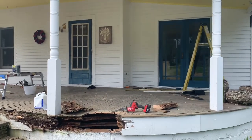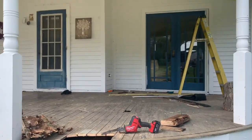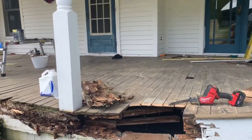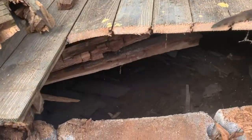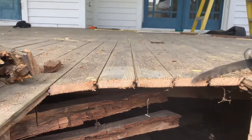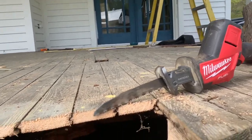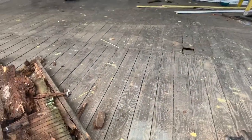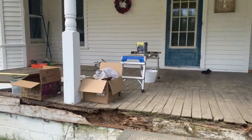The project today is removing the wood decking on this porch. It was originally a three-season wraparound porch that was opened up about 30 years ago, so we have excessive rot underneath it. I priced out doing Trex but it was way too much money. I don't have to rebuild the whole sub floor. Pressure treated doesn't seem to hold up anymore, so I'm going to backfill all underneath here with modified compacted and poured concrete.